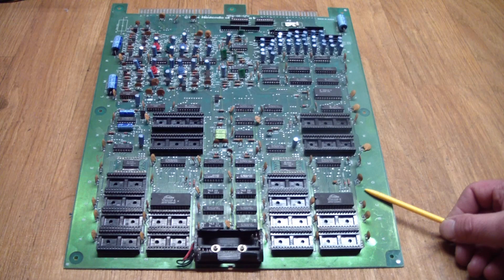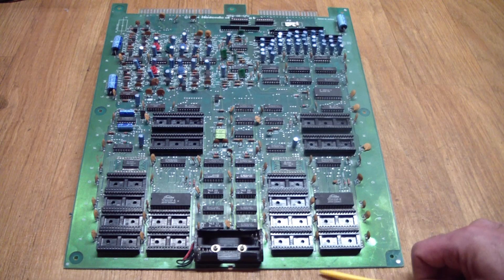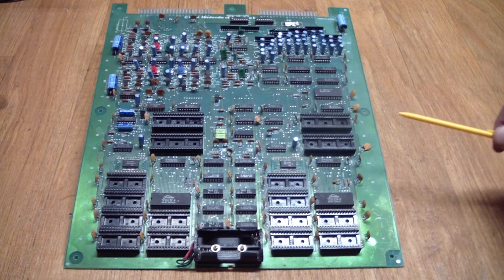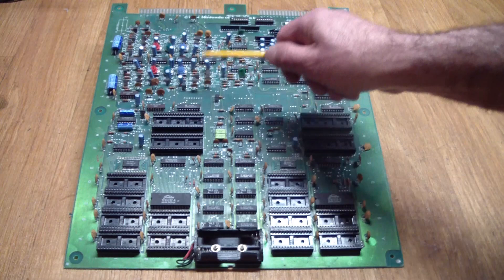Just like their forefathers, these were built not as dedicated single-game arcade boards, but rather they were intended to have you replace ROMs to change up the game once the current game wasn't making money anymore. Except they tried to keep it cheap — they didn't put cartridge slots on these, but rather they have six sockets on each side that you can put up to 48K of EEPROMs in that are the game. This is what Nintendo calls the main side — essentially a complete NES with some pieces up here too.